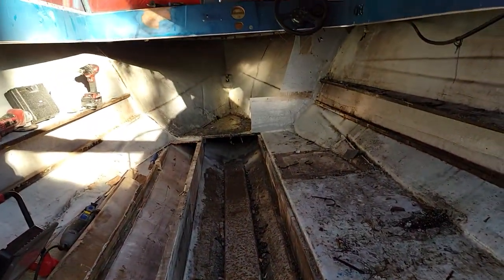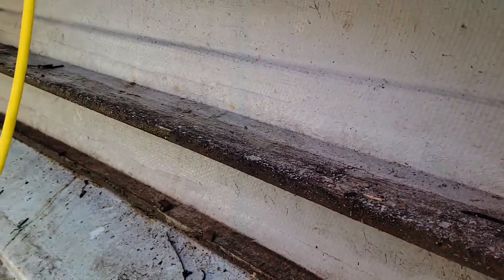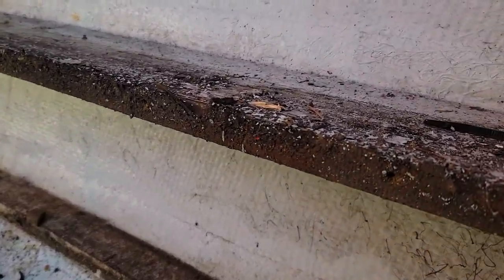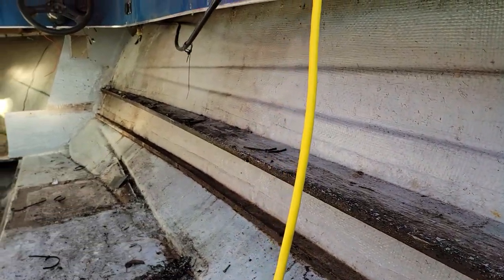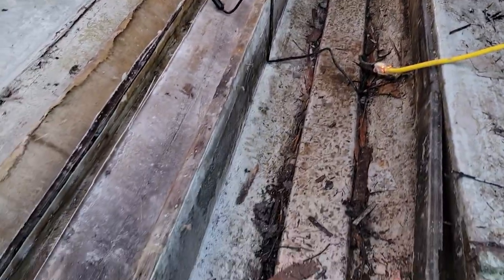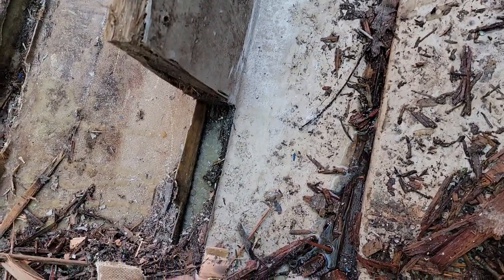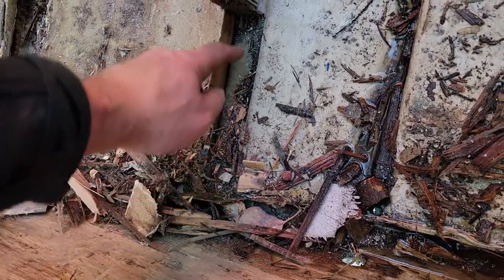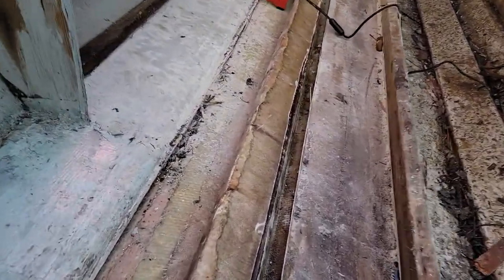Just a little update — I've been out here for a few hours enjoying the weather. These will probably come out too and I'll put some new wood here — they're a little rotten. It's not like they glassed them into the sides, but they left a lot of that wood exposed up top so it's pretty rotten. I'm guessing I could get that out in one piece and then trace that curve — you can see that nice curve on it — which is what I'm going to do for these stringers. Remove it all in one shot from here to there and mark where I cut it off.